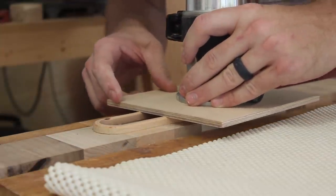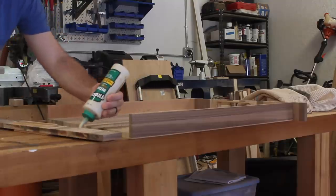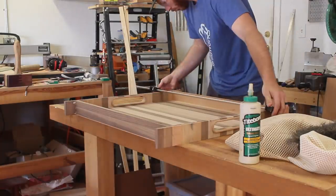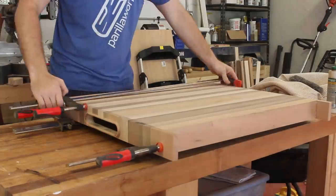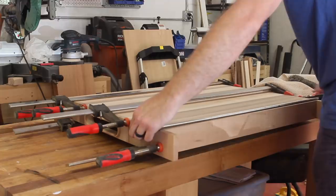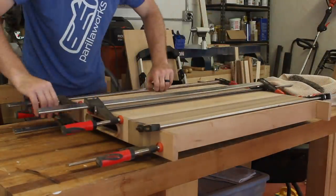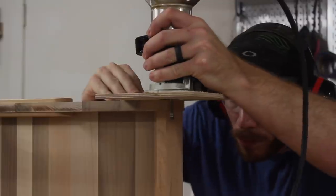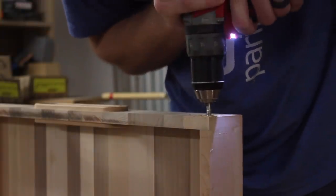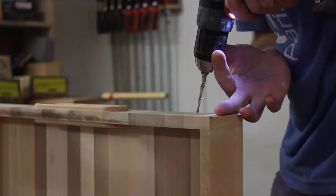This was about the time I realized I should have flipped the order I cut the sides and ends. Because the sides were already glued on there wasn't an easy way to reference the edge of the piece with my dowel jig. This was an end-grain glue joint so it definitely needed reinforcement — my workaround was to glue it up while lining all of the strips perfectly, and then come back and reinforce the joint with tapered dowels that correspond to a tapered drill bit. These dowels are perfect for situations where you have a joint already glued up but still want to reinforce it, and the walnut dowels look really nice too.